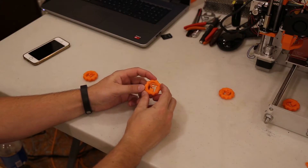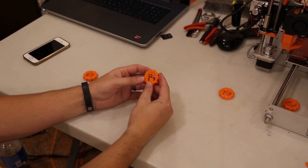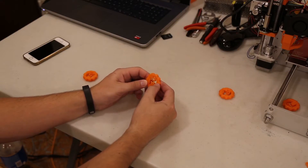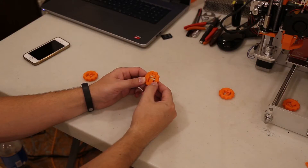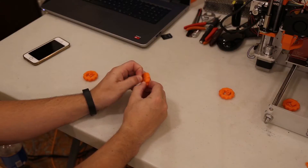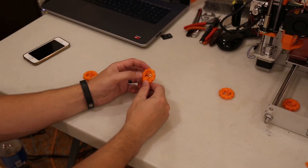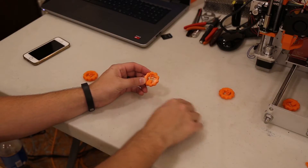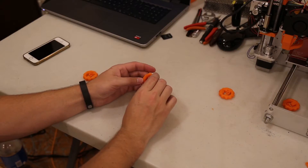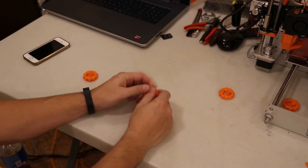Then I did this one. You can see the logo is correct — FT — but you can see at the bottom it shifted. My bottom few layers shifted on me and it didn't come out quite perfect. The very last layer laid there, but the first two on part of it got shifted over. I'm assuming a little bit too much filament came out and when the nozzle dragged over one of those areas it kicked it a little bit. So yeah, that one's totally wrong.